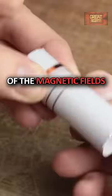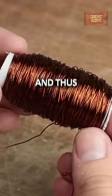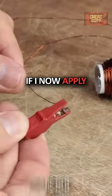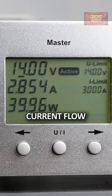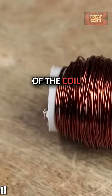To improve the strength of the magnetic field, we could wrap a bigger length of wire around a PVC pipe and thus create a coil. If I now apply 50 volts DC to it, around 3 amps of current flow, and my ferromagnetic iron bar is pulled to the center of the coil and stuck there until I release the voltage.